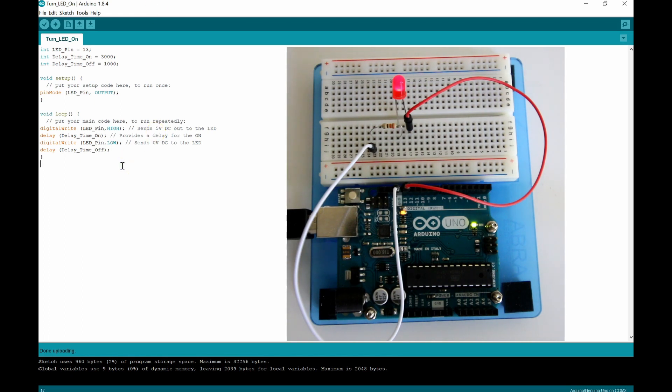That's pretty good for this lesson. We created a program using LED pin 13, flashing that LED on and off by creating a HIGH and a LOW, with a delay in between measured in milliseconds. Then we discussed global variables — by declaring them at the top, we only have to change the value once and every instance in the program updates below. We did that for our integer LED_pin, changing it from 13 to 12, and we created separate delay_time_on and delay_time_off variables to independently control those timings.